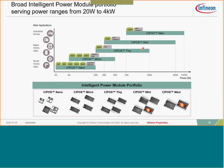Our IPMs are used across many different applications. They're very commonly used in the appliance marketplace — washing machines, dryers, dishwashers — and extensively in low-power industrial drives from companies like Siemens, Danfoss, Rockwell, and ABB, generally sub-four kilowatts. There are also applications in integrated water pumps and fluid moving systems. Some products like the CIPOS Mini are produced in excess of 50 million pieces per year.